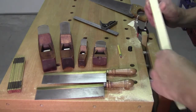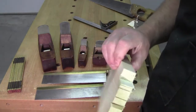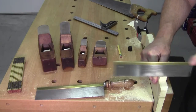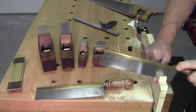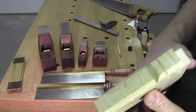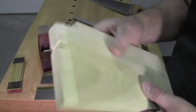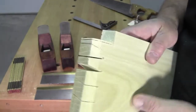It leaves a little bit rougher cut — can you see that? A little bit rougher cut on the end grain compared to a crosscut. So if you plan your cuts well so that you can plane or pare off the crosscuts, it's a moot point. Use a rip tooth.